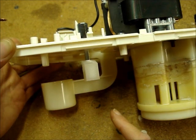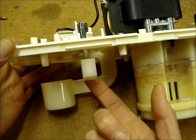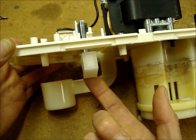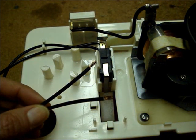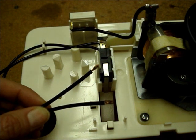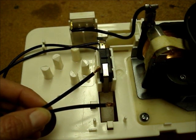If the pump fails and the water in the reservoir fills up and pushes this float up, the contacts on the switch will open. To prevent water from overflowing in the reservoir and causing a flood, it shuts down the heating or air conditioning system.